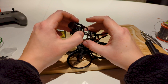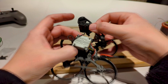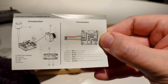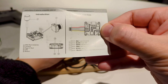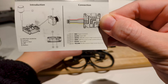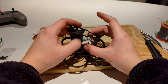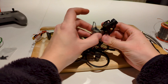On the drone itself, the VTX — the RunCam Link — you need to solder it yourself when you buy it. There is a guide included with the drone on how to wire it. You can follow the instructions that came with the VTX. I checked the flight controller and the RX and TX are in the right position: connect from RX to TX and TX to RX on the flight controller, and red and black accordingly.